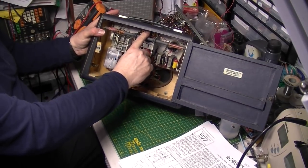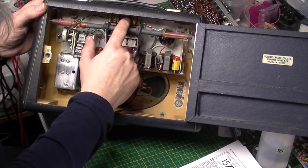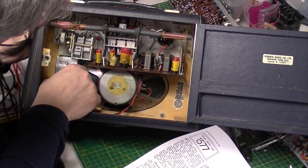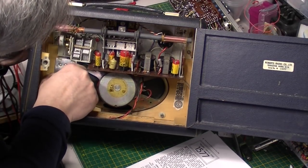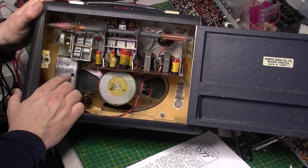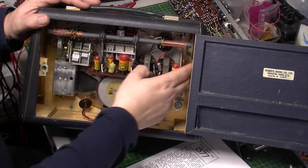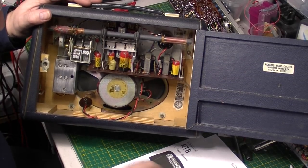We've got a separate board up here for RF — let's get in a little bit closer. So we've got a separate board up here for the RF and that's got an AF117 in it, and this IF board down here. It's very loose and wobbly — it looks like it just unhooks or something. I have got experience of those modules. So we've got two more AF117s in this module. And then this is the amplifier board or the audio board — it's got audio transformers in again, two outputs on the end here. The output transistors are VT7 and VT6 — OC81s as a pair.